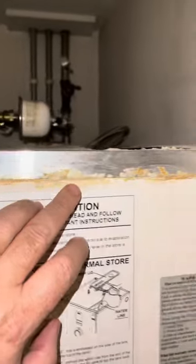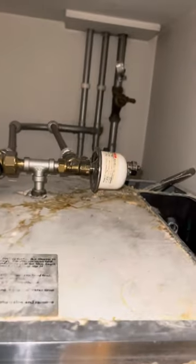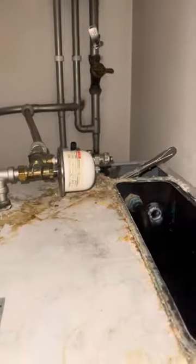If you look here very closely you can see where it's all been overheating — it's just covered in limescale. The top of the unit here is also very heavily scaled up. There's the lid, a blending valve, a little shock arrester, and it goes onto the cold water mains.